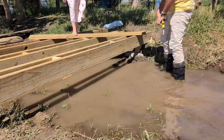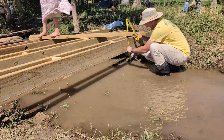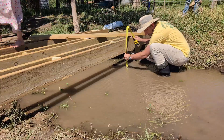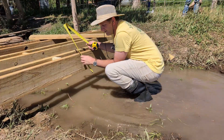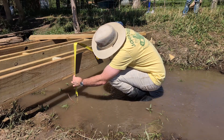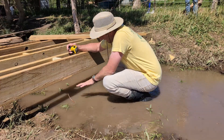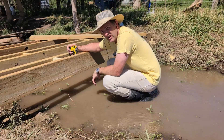I just had to check and see if my level was good — and what better way to check the level than to measure to the water. From the bottom on this side, just touching the water, I'm eight and three-quarter inches. Now let's check on this side — as long as our water's level it ought to measure the same. Down till we just touch the water — I have eight and eleven-sixteenths. I'm one-sixteenth off level. Either that or this water isn't level. I think probably my level's right and the water's off.